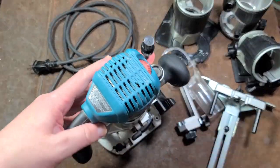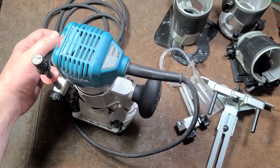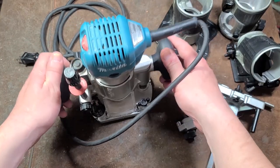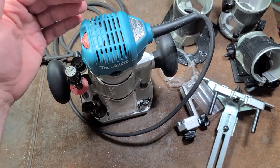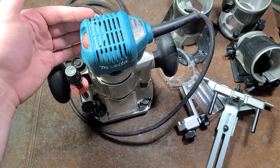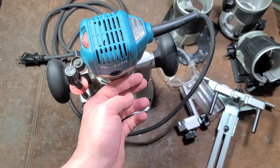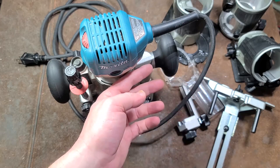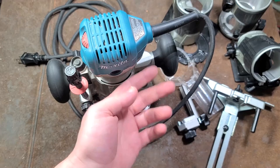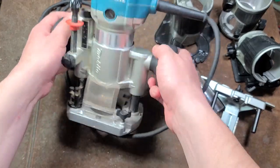There may have been some kind of plate missing on the plunge base since I bought a used set. But overall this is a pretty impressive router set. Even with some missing accessories on the newer ones for $240, you get nice electronics, variable speed, constant torque, soft start, and a 6.5-amp motor. It's a genuinely honest quarter-inch router — smaller and lighter duty, so you're not going to be doing lots of heavy cuts without going slow and easy, but it's convenient and easy to deal with.